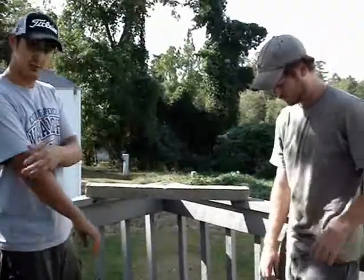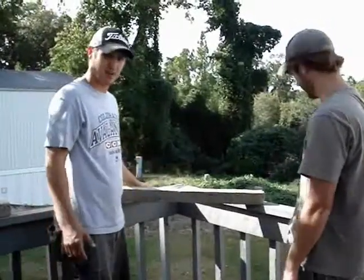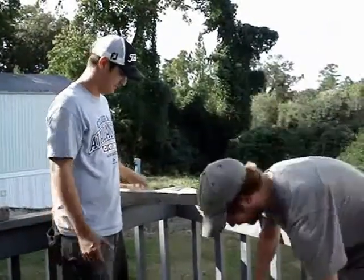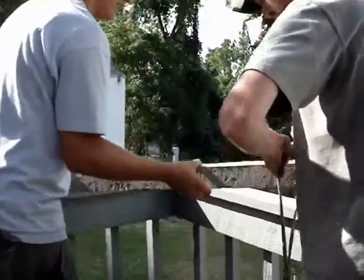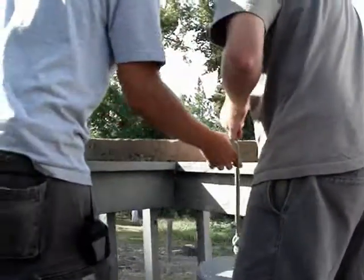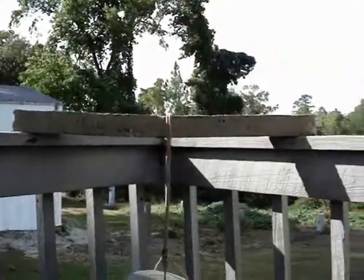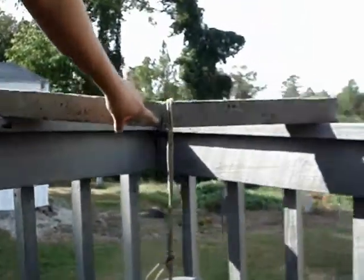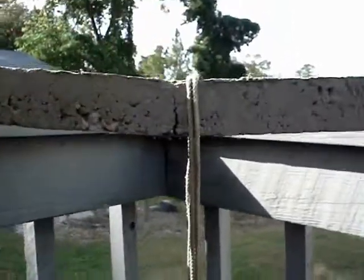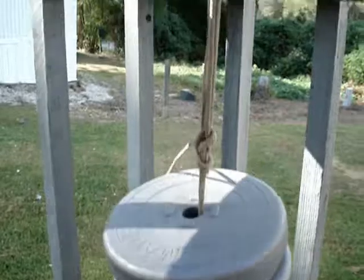As you can see it holds — positive bending moment. And now we put 15 more to make it 65 pounds to see if this will break it. As you can see it pretty much cracked, like we went over in class, but all the tension force is on the rebar inside, so it's not quite breaking in half. But it's pretty much broke.